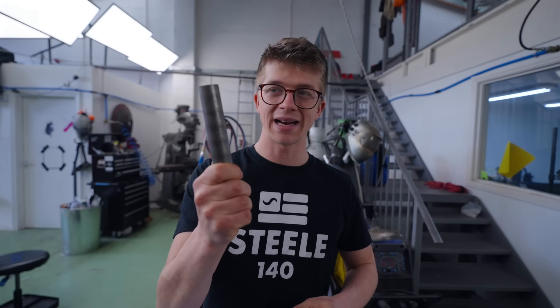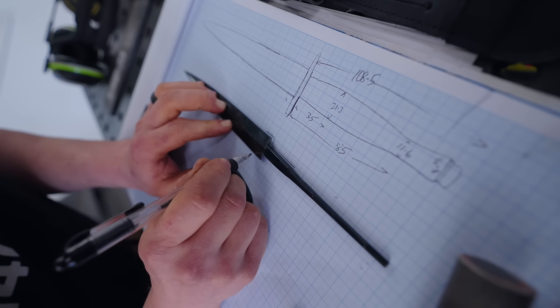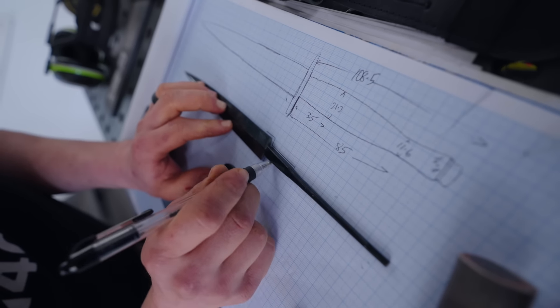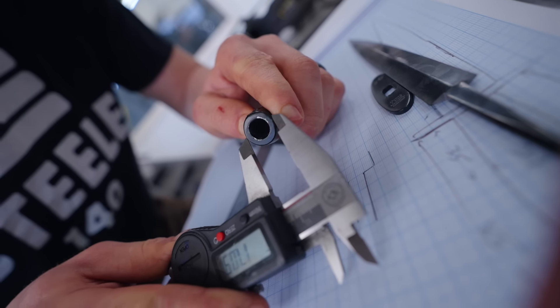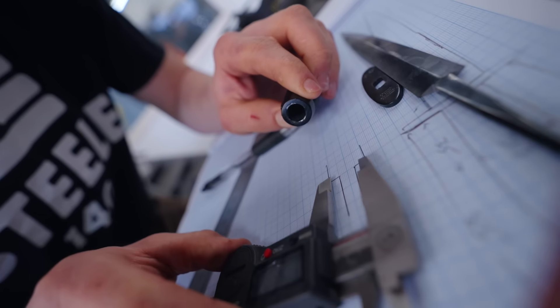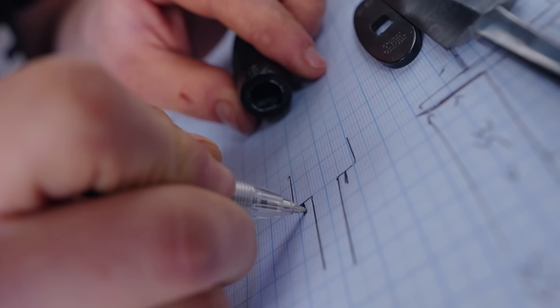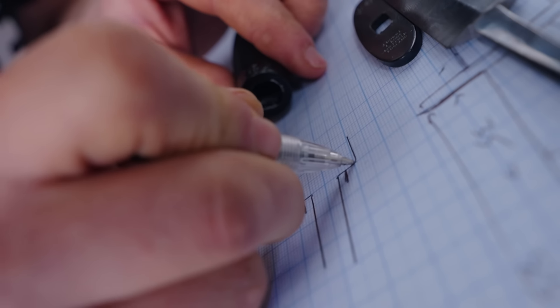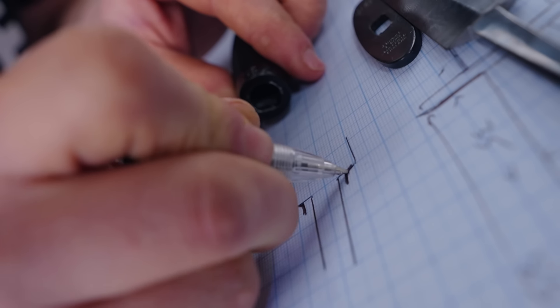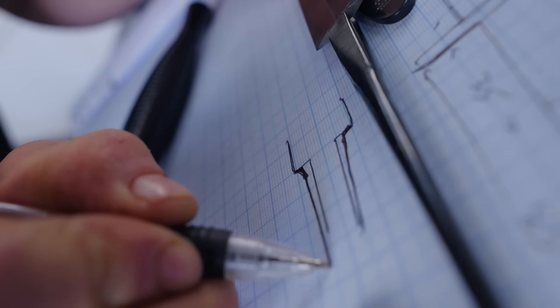Hopefully we can make some productive tweaks in the design so ours is nice and sturdy. The first thing we're going to do is get started on the handle — we're going to make ours out of bronze. Looking at the blade, I don't see any reason for the tang being quite so narrow, and that affects how we make our handle. The first step is making the slot. The tip of the handle is about 17mm thick, which means the front portion of the tang could be much broader. I'd also want to incorporate a nice radius in that transition to minimize stress concentrations.